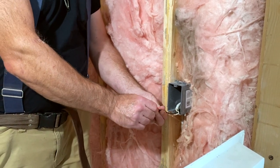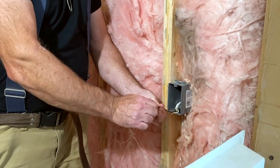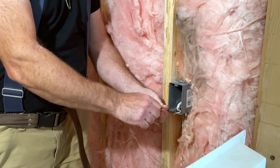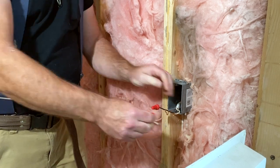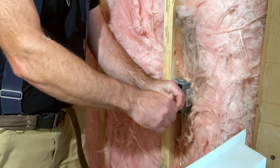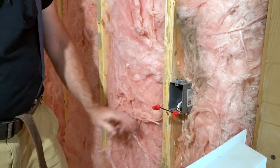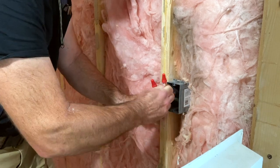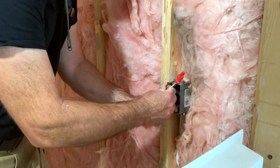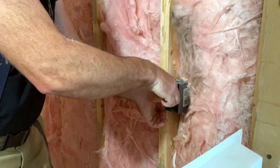So we want to make sure we protect ourselves from these open wire ends. One easy way is just not to cut the wires — don't strip them back — but you can also make sure you put on a wire nut. Give it a good tug to make sure it's not going to come off. And although that's a common and not hot, we'll go ahead and cap it as well just to make sure we stay safe.